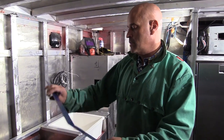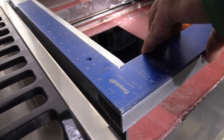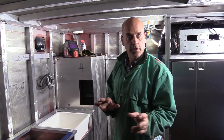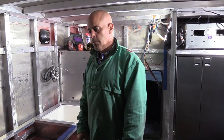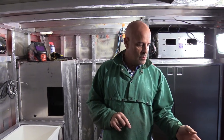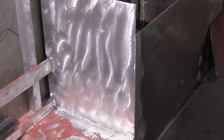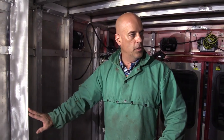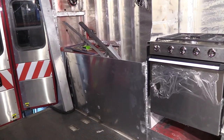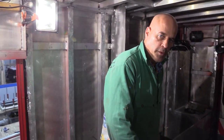This is kind of where we're at for right now — we're obviously just going to continue on. The nice thing about the aluminum is you can really square it out. You can see how nicely squared that is, and when you're welding aluminum it has a tendency to move, so you've got to keep checking it. But you can see all this stuff is going to be really nice when it's set up. We'll take a look at the other side now that I've finished up — this side came out pretty well. It's starting to give you a little bit more of an idea of how this is all going to lay out.